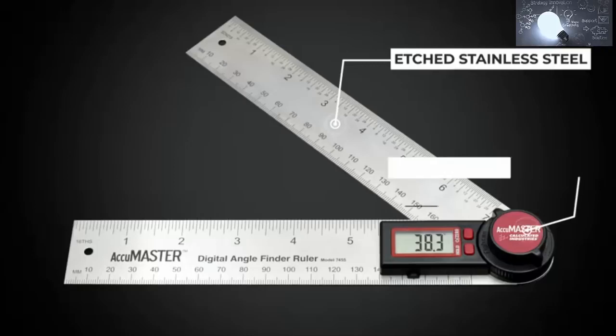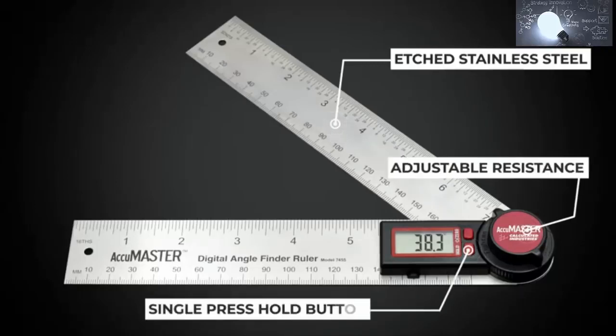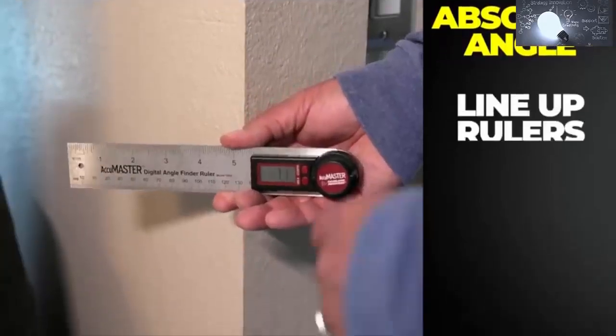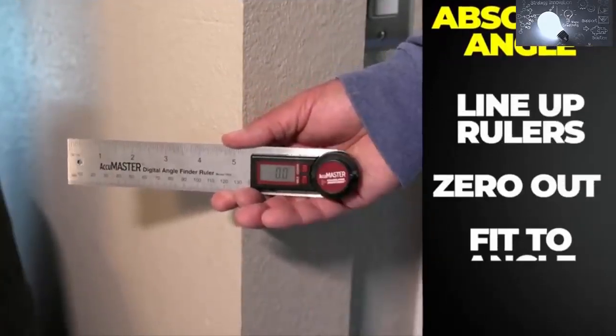The stiff action will retain the measured angle so you can move it and get a closer look. Or press the hold button to freeze the measurement on screen. Another press will clear the display for the next reading. To take an absolute measurement, line up the rulers and zero out the device. Then spread the rulers to match the shape of the angle.